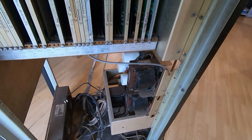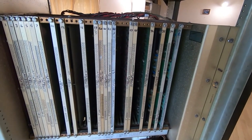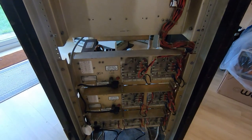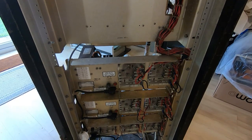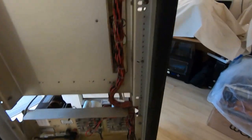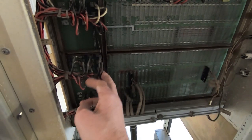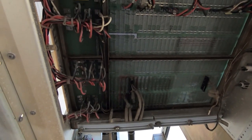It's a very nice arrangement. There are upwards of around two thousand ICs in this machine, so as we might expect, there are huge linear power supplies and this thing weighs a ton — mostly because of the transformers and power supplies, plus it's a larger rack. Looking at the back, there are a lot of fuses and separate power supplies. Some supplies are negative, and having them floating means they can be arranged however you want — but bear in mind not all the grounds here are ground at the other end. The motherboard is in a fairly poor state with quite a lot of corrosion on the connections; this will need cleaning up.